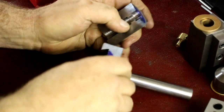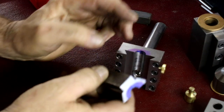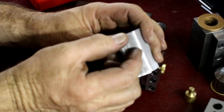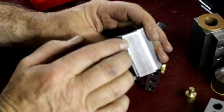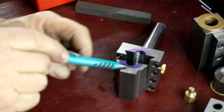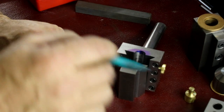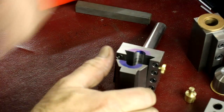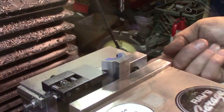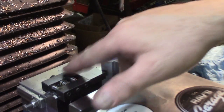We have that hole in that we're going to thread. Now we're moving on to more work on the cross slide — we need to put in holes for tool holders, a locking screw, and such. We're going to be drilling down through this area all the way through, and some threading for M5. We're continuing with the cross slide sitting on a half-inch parallel. I put a one-inch gauge block in there and did not move the setup, in case I needed it as a reference.